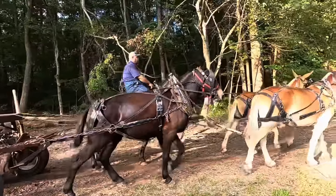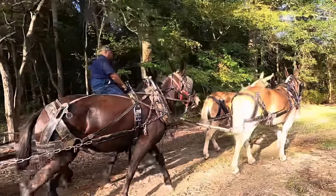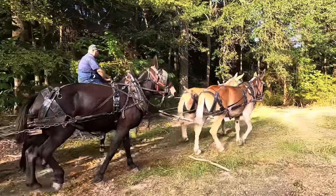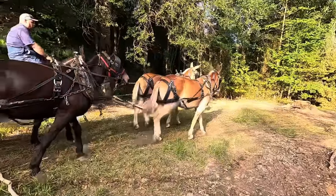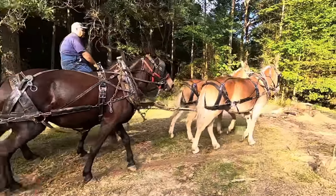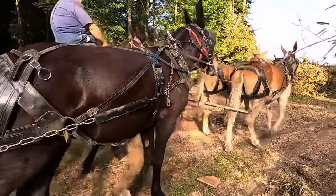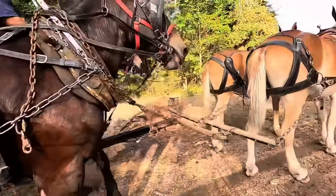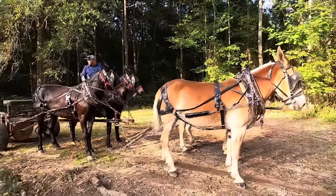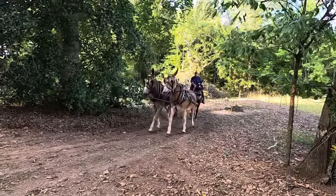And speaking of different species, like this pin oak here, of red oak, it's roughly 15 pounds per board foot. And like I say, this is a 330-foot log. Where poplar logs are like 9 pounds a foot. So there's quite a bit of difference in the weight in the species of tree. Lighter hardwood like basswood, poplar, cottonwood, etc. That's a lighter species of hardwood versus red oak, white oak, maple, beech, hickory. Those are all the heavy species.